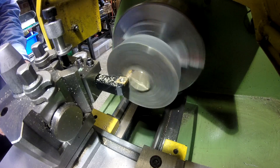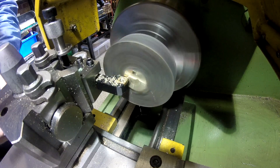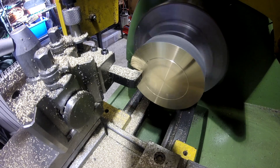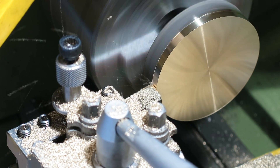So let's get the casting over to the lathe. Now on the Clickspring gyroscope wheel, he uses a superglue chuck. I'm not sure I really trust that, so what I've done instead is make the casting with a spigot on the back — I can hold that without any worries.